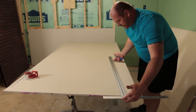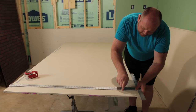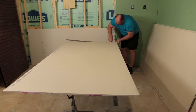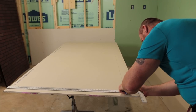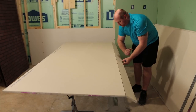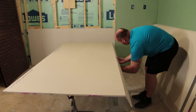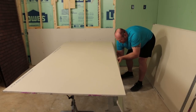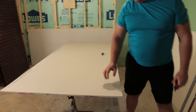You can cut one half and then turn around and come back and cut the other half with the T-square, but I find that kind of tedious. One thing you can do that's pretty easy is use your T-square kind of like a slide rule — put your knife on the mark and just start sliding down. Go all the way to the end and you've got your cut, then come back and finish it out. You notice I didn't cut all the way through, but you just give a quick tap with your hand and it comes off, then reach underneath and cut it on the back side. Make sure you cut all the way through. And then your piece is trimmed down and ready to cut the holes for the plugs and light socket. That's how you do that.